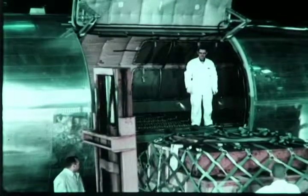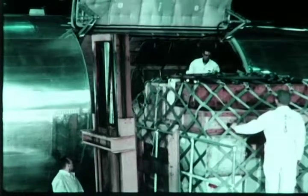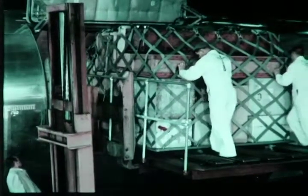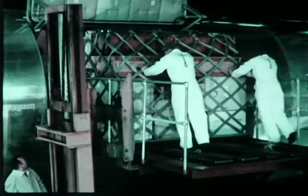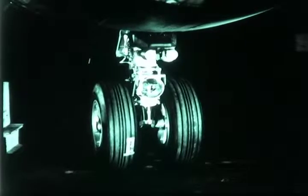This cargo handling system breaks away from the notion that an aircraft cargo loading system need be complicated. Loading the aircraft is begun by positioning the forklift, leveling the staging with the truck bed, moving the pallet onto it, and raising it to the level of the aircraft floor. With the loading of each pallet, there is some change in the level and the fore and aft slope of the aircraft floor, of course, but the change does not greatly affect the movement of loaded pallets in the aircraft. And, just as in unloading, the mast of the forklift may be adjusted to compensate for differences between the slope of the floor of the aircraft and the staging platform.